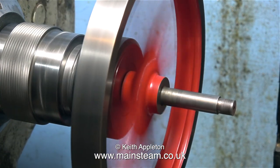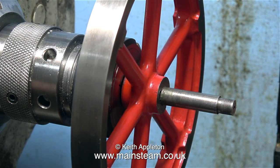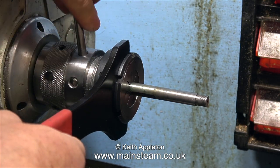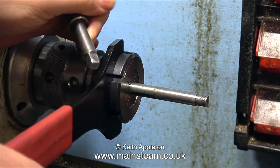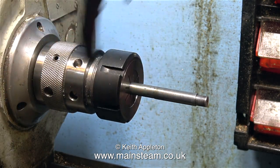This is impossible — something is wrong. To confirm this, I turned the whole thing around in the chuck and it was still very wobbly. The crankshaft is quite a good fit in the flywheel, so I tapped it out of the flywheel, put the key in a safe place, and here I'm just putting the shaft in the collet chuck.